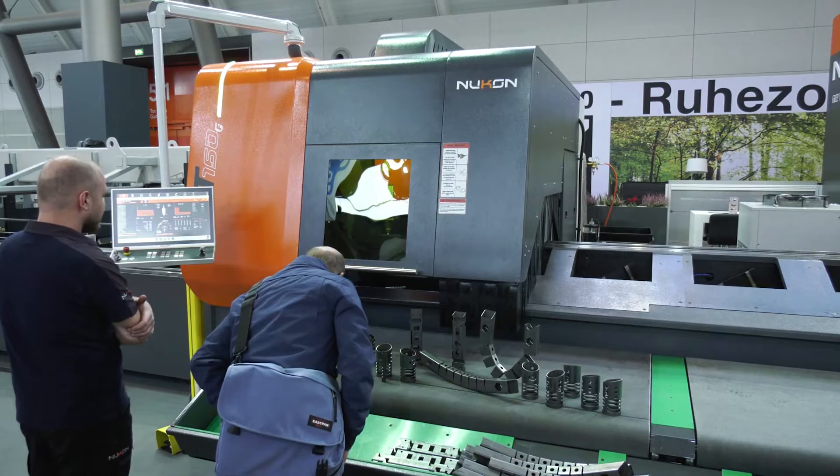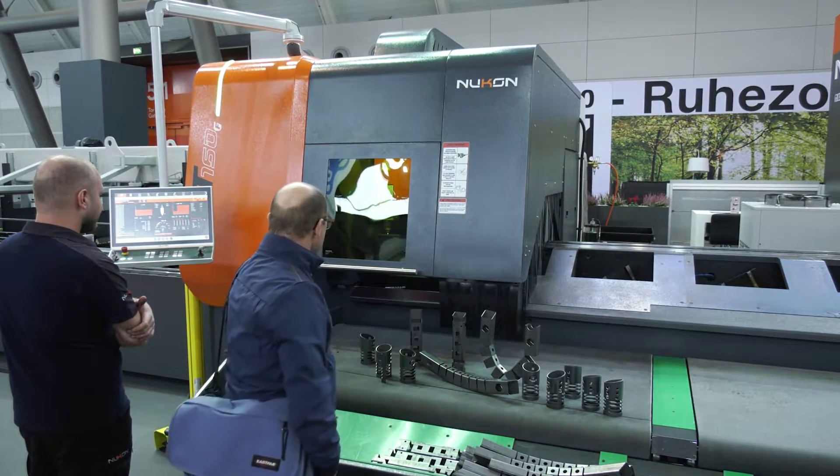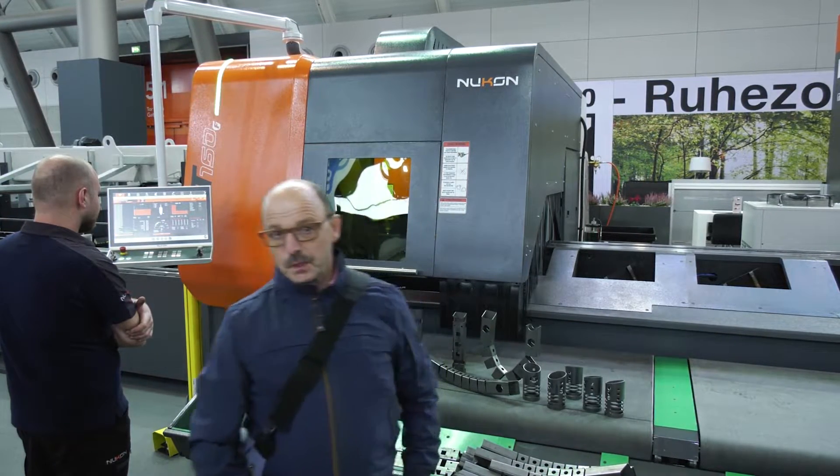So you're doing your profiles — what sort of power does the laser provide and what depth of cut will that do? Three kilowatt will go up to 8mm of cut in mild steel, but most tube is between 2 and 3mm or thinner.